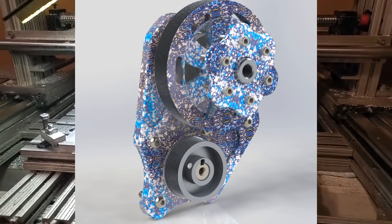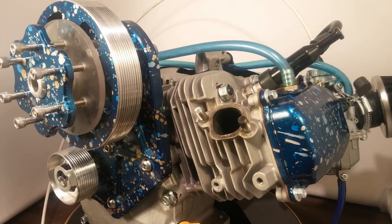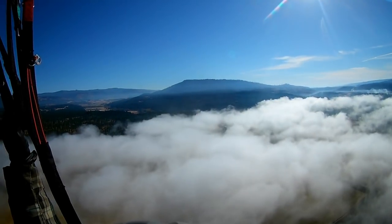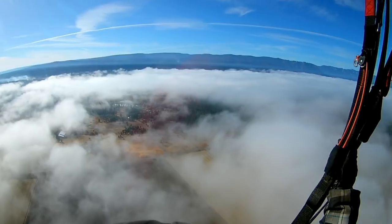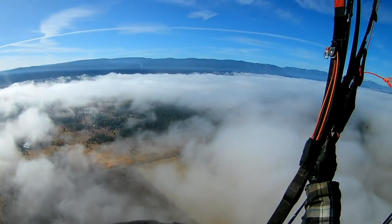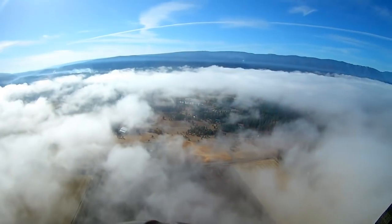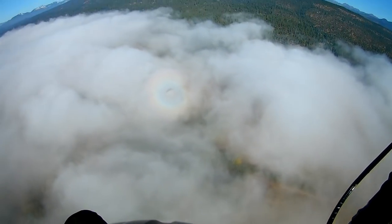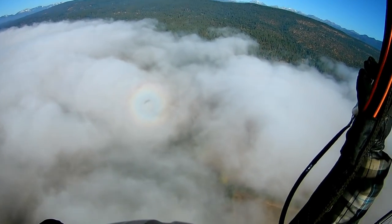The one thing I ran into later is the micro V width I chose was about one inch, and because the lower pulley — the one that hooks up to the motor — is pretty small, over time the belt would either stretch or wear down enough to where I would start to slip, and I'd be down on power again. So that brings me to today's project.